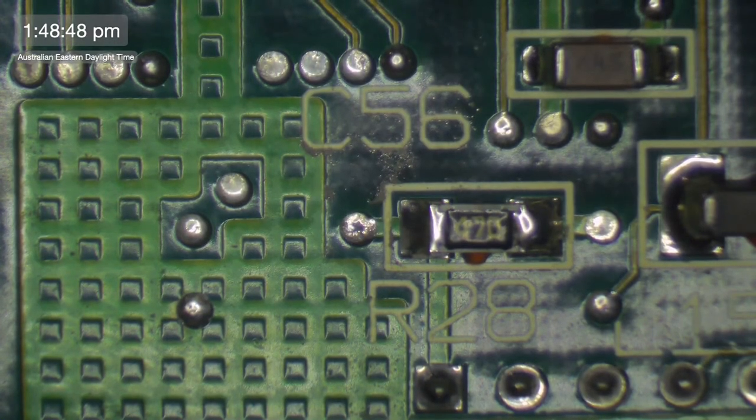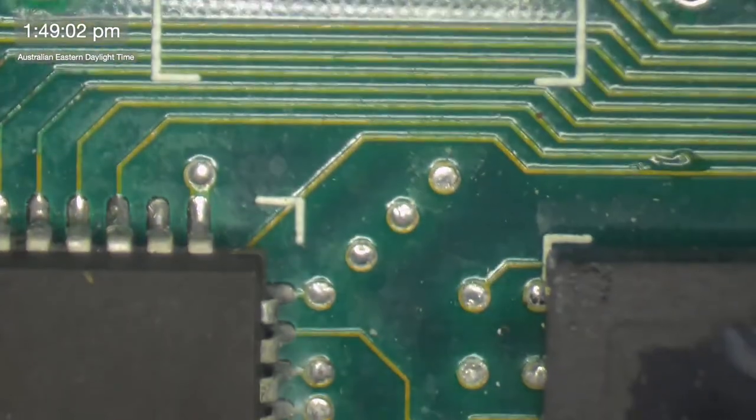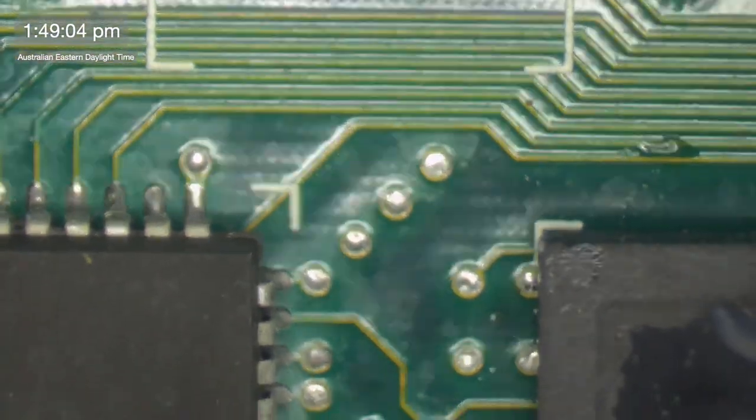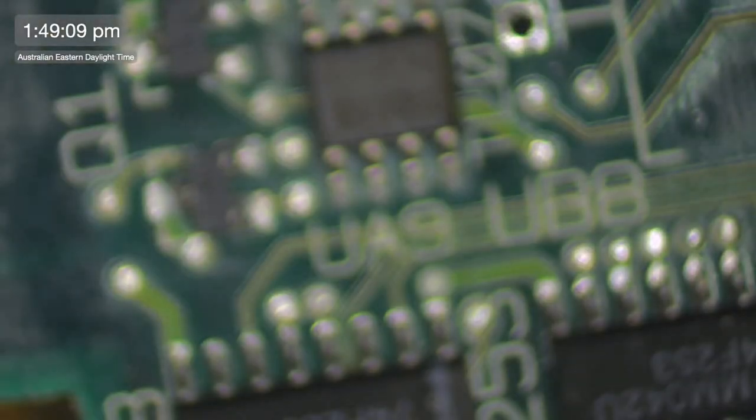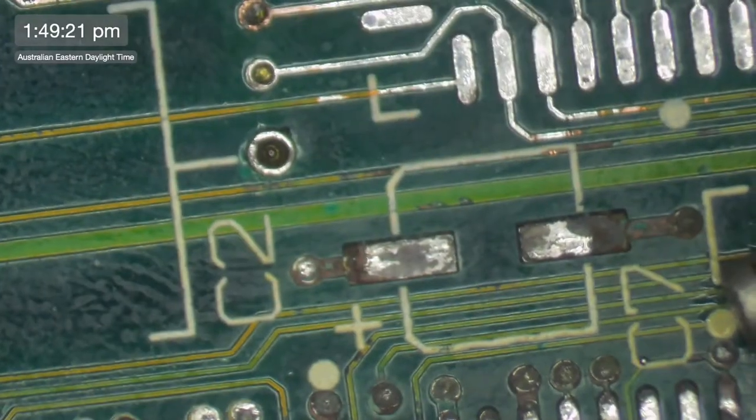And that's the one that's all the way across here. It's going to be a long trace wire. And then I think we'll probably be done. I think we'll be good to go. So I don't really see another way around it. It's very clear that this is going through the middle of the board. The way I can tell is because it's a via that has no trace on the top and no trace on the bottom. So if it has no trace on the top and no trace on the bottom, we know it's going through the middle.